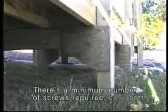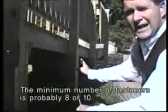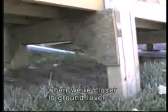In this area, we can see the 12 by 12 inch treated plywood bearing plate set right on the ground, which is part of the nice design for this demountable bolted ramp system. Once we get to the lower sections under 21 inches above ground, we can drop the diagonal 2x4 bracing and use plywood gussets. A minimum of 8 or 10 screws is required, providing sufficient strength closer to ground level.